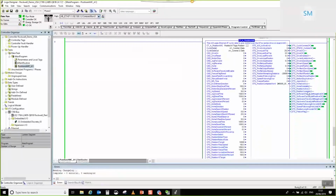What I tend to do, before I get going, if I just hover my mouse there so that you can see, I tend to toggle the STO on the drive. So what you can see is me toggling the switch, and you can see drive enable coming on and off, and that's a fairly good indication that not only is your comms up, but you've got real-time changes happening at your PLC block. So that's what I tend to do.